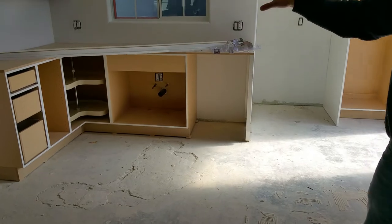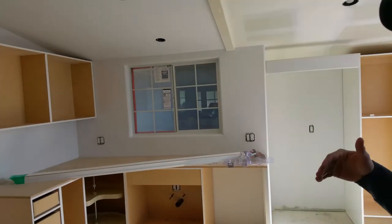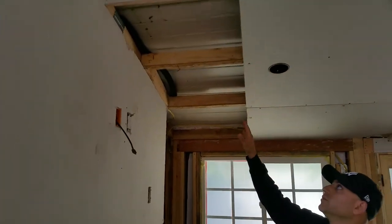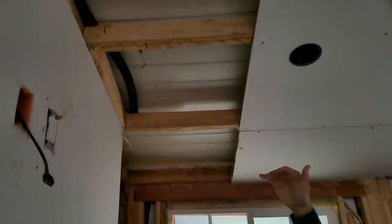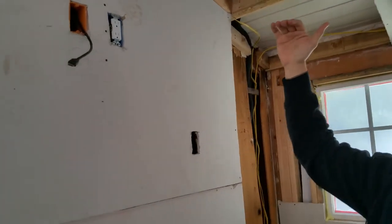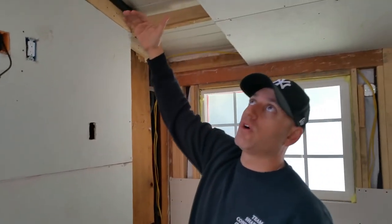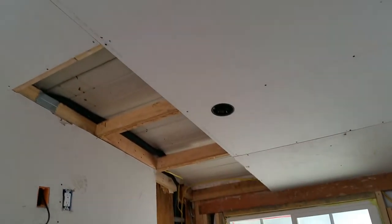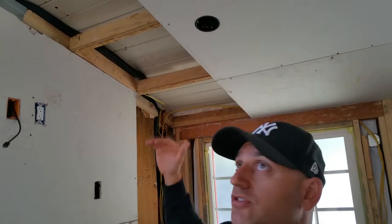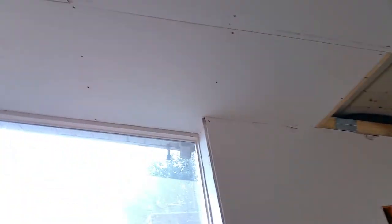Also, just above it, we had to center the window and we were dealing with the ceiling — the old 50s and 60s design with the plank paneling on the ceiling. So what we went ahead and done was we framed out the ceiling and we placed drywall. At the same time, we ran electrical lines inside, and this allowed us to drop the ceiling by about five and a half inches and install four inch recessed can lighting.